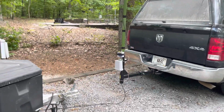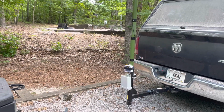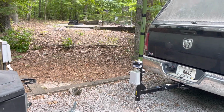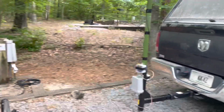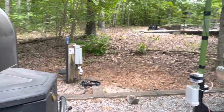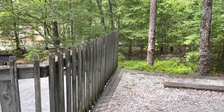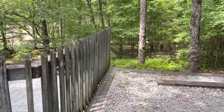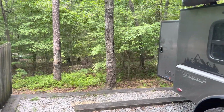My antenna, of course, is my standard 28.5 foot random wire antenna that I call my K-2187 antenna, and it just works really, really well. I've been real pleased with it, and whenever I can camp like this where I'm not backpacking it, this is my antenna of choice. I will be operating low power, hopefully in the 5 to 10 watt range. If band conditions are real bad, I may bump it up to 20, but I really want to do a more low power and more low-key operation.